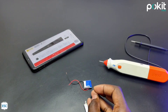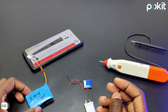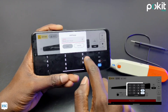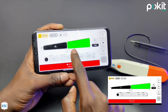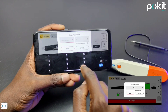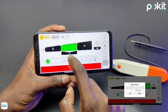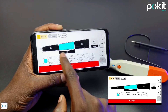The normal voltage of a lithium-ion battery is between 3.2V and 4.2V. Here we are going to set that range. Click on the plus icon — I have given 3.7V. And in the tolerance I have added 0.5V, so now the range is 3.2V to 4.2V. We can also select the color from here; I choose cyan color. And that's it.